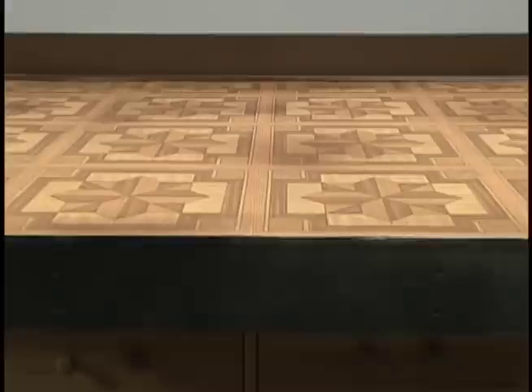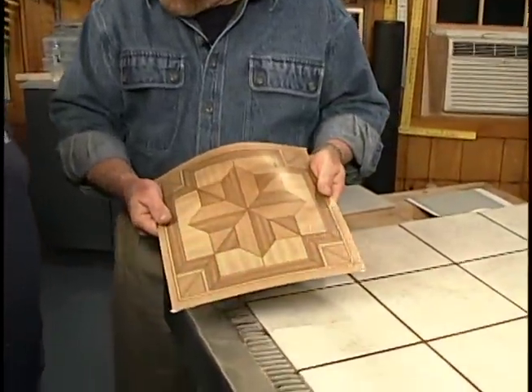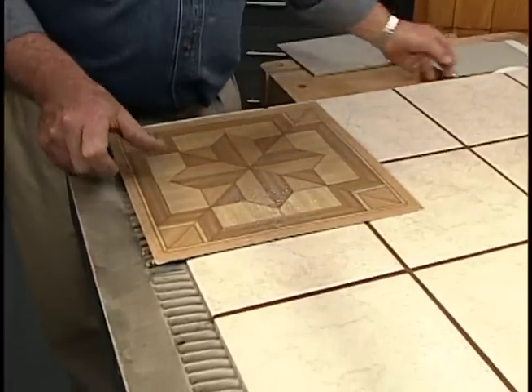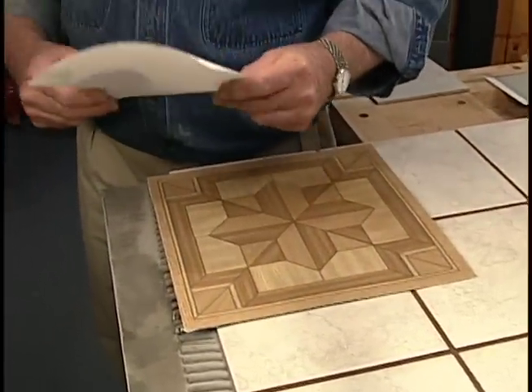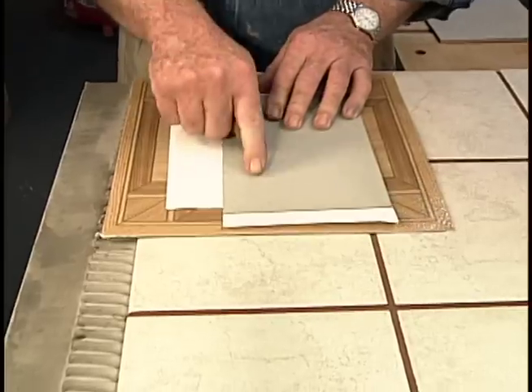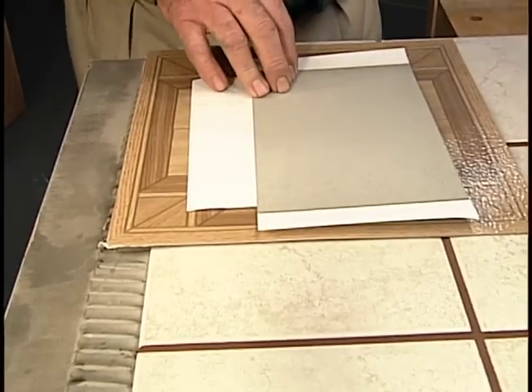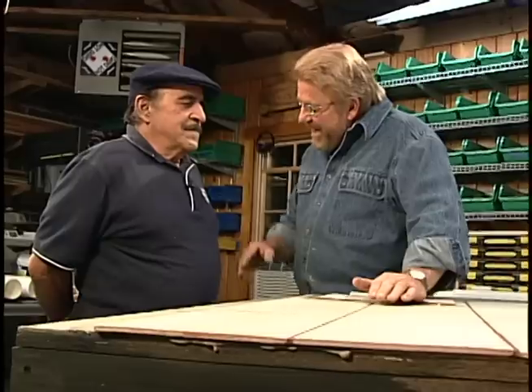Done. Let's remember back to what this looked like just a few hours ago with that vinyl. Very interesting process — you began with the vinyl composition tiles. Then on top of that went the thin skin. On top of that, you put the first thin coat of thin-set, then the tile-setting mortar applied with the teeth of a trowel, and then we installed the tile. You've got your name and your face all over this system — does that mean it's personally guaranteed? That's right, Ron. I'm fully confident, and I have a written 15-year warranty.